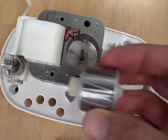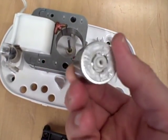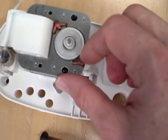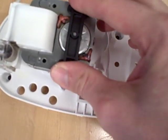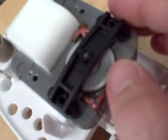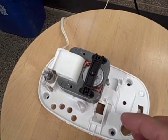I'm going to drop this rotor in place. To show you — this rotor has no wires on it, no brushes, no commutator; it's just a drum of aluminum with some iron bars. It simply fits inside with no touching parts. I'm now going to set the top bearing assembly in — that holds it in place better. And now I'm going to turn the power switch on. And it spins. That's a very simple induction motor, single phase.